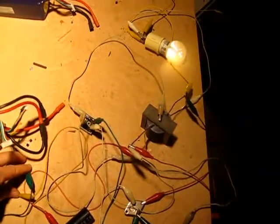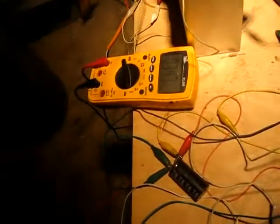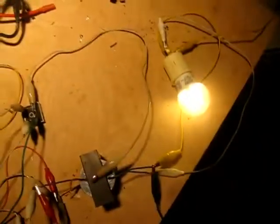This circuit is incredibly sensitive to being excited from anything in your environment. So that got me thinking about taking a DC inverter and trying a few experiments with that. I've got the LED light connected coming off the inverter. I'm going to connect to the inverter plug here — just one of the prongs. Running through the LED light to the ground. Nothing, just as you'd expect. The only way to get any light would be if I crossed over to the other connection in the inverter. That makes perfect sense. Now I'm going to do the same thing but run this through the circuit to the ground. I've got the inverter here and I'm going to connect the negative line off the capacitor to one side of the inverter — and you see the light comes right on.